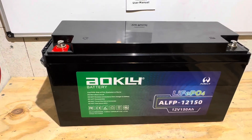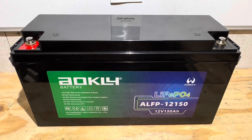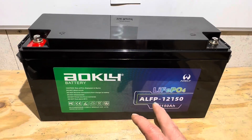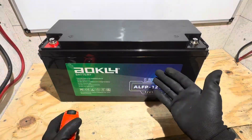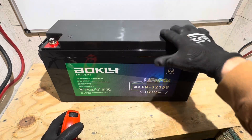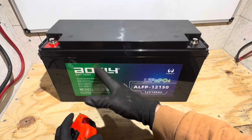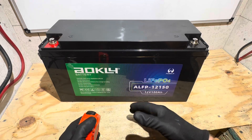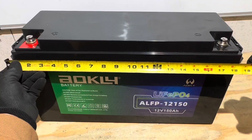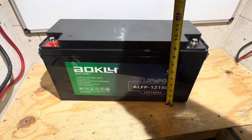It came up a little slack on capacity, but close enough — I'll continue on. I'm going to tear this thing apart and make sure everything's balanced inside. But let me talk about the size of this battery first and give you a couple of specs before the teardown. The first thing you may notice is it's got an oddball, odd case size. The case is a different size from what I'm used to seeing, especially on a 150 amp hour battery. We are 19 inches long and 9.5 inches tall.